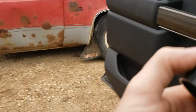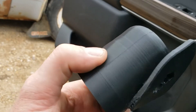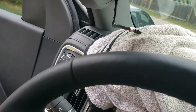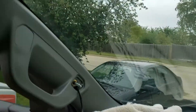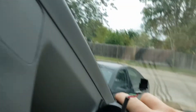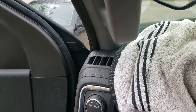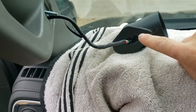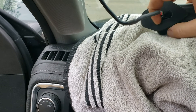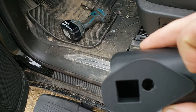Here's prototype gauge number one. It had a square for the wire to pass through, but the mounting hole got mangled by a drill bit because it doesn't quite want to slide on — I've been drilling it out trying to make it fit. We have a couple of problems: it's rubbing right here so I need to add more angle to the gauge, and we need to redesign the mounting hole and do something with the wire slot to make removal easier.